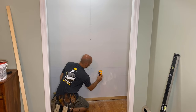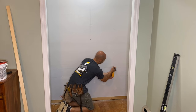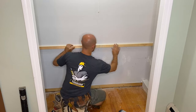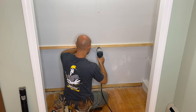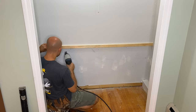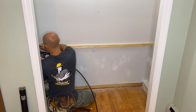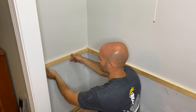So here I'm using my trusty stud finder to mark off the studs, because when I put up my blocking here — three quarters of an inch below the top of my desk — I need to know exactly where the studs are to nail. It's imperative that your blocks are level, so make sure you draw a level line all the way around your closet. You don't want to work on a crooked desk.